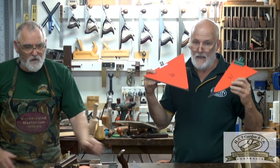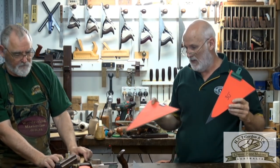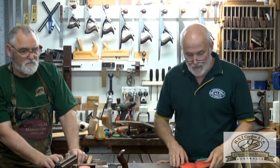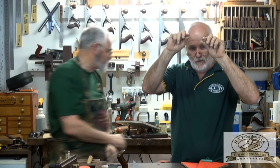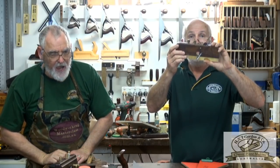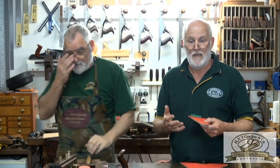When we send a plane out it'll have a 30-degree bevel, but if you don't resharpen at 30 degrees and it gets to this point, you're going to have trouble getting good results — whether it's a metal plane or otherwise. If you resharpen to the 30-degree bevel, you'll never have problems with a sharp blade. My half-inch dado plane had a gadget for measuring angles at the end, and it was actually at 40 degrees — meaning I'd lost one third of my usable sharp edge.